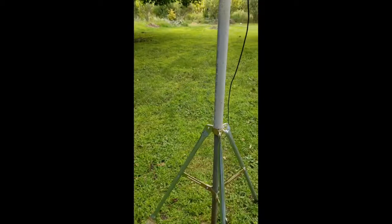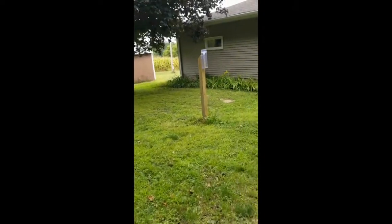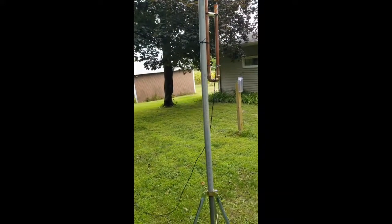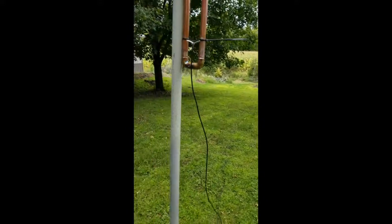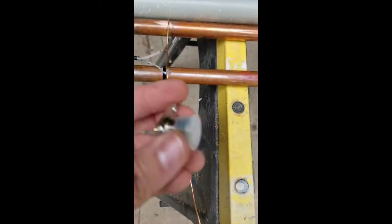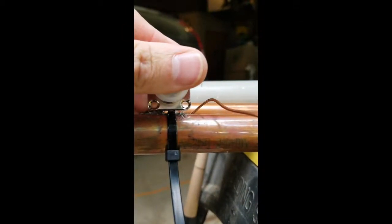My plan now is to hike this up somewhere and figure out a mounting area. I'm going to put a few bolts in here to make sure this doesn't move and wobble. Strength-wise I think we're actually pretty good — it might flop a little bit. You do have to keep some separation between the metal and this metal because it will start making use of that as an antenna as well, and that's not a good thing. So here is the plan: we're going to solder this piece of copper wire in here. This is the SO239 connector — we'll solder into here. I think I need to use the big solder iron to get that one mounted on there.